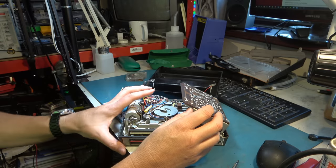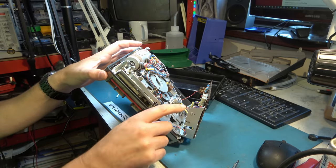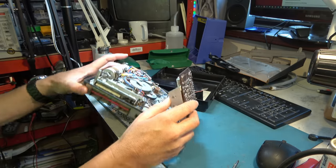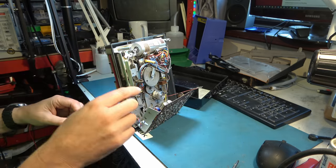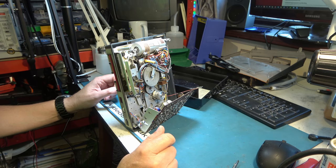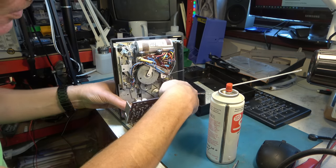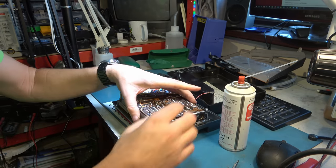That's good enough for now if I need to rewind the tape. So our biggest problem is going to be powering up, but then there's also whatever state these ancient capacitors will be in. And there's a big record-play switch which we should give some switch cleaner to. Capacitors of this vintage don't so much go high ESR - they go internally leaky. So that could be an issue. There's not a huge amount of capacitors, but it would certainly take some time to change them all.